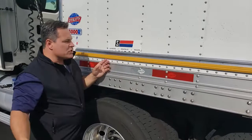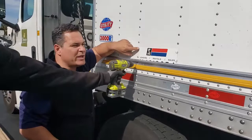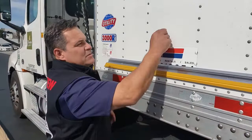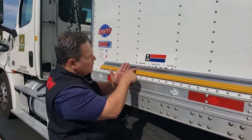Item number two: you'll see where George just had the drill. This vertical line of rivets represents a post. You want to make sure you hit at least two posts in every length of frame. The reason is, this metal here is typically flimsy, but the metal on the post does not move. So even if we don't have a hole pre-drilled there, you're going to want to pre-drill that hole and then put your screw into the post. It's just a secure, safe way of doing it — eliminates liability.